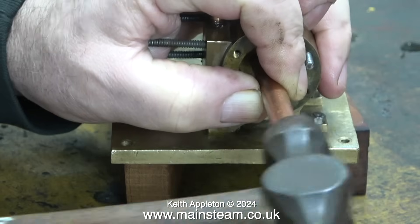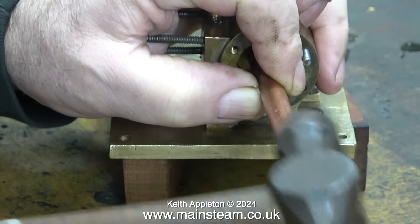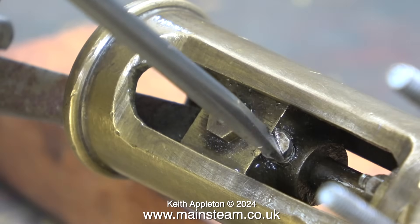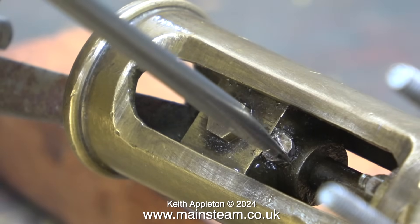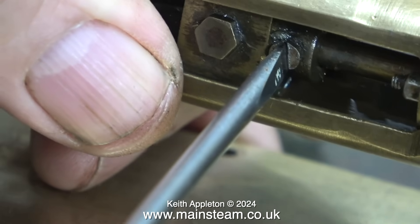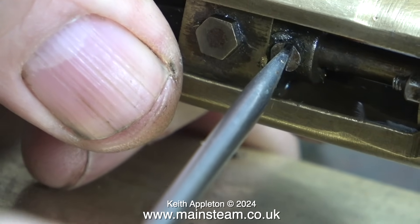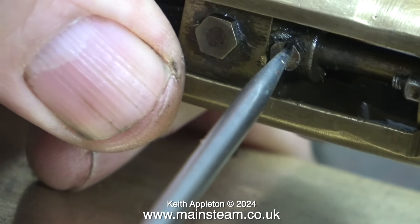Initially the piston is quite a snug fit in the bore — that's exactly what I need. Now it's time to fasten the piston rod back to the crosshead. When tightening screws, make sure the screwdriver is in the centre of the slot, and the piston rod is re-secured to the crosshead in exactly the same position as before.